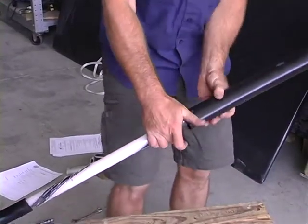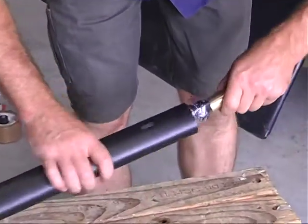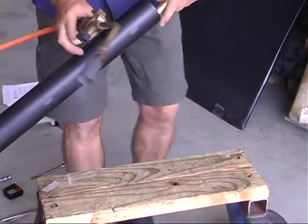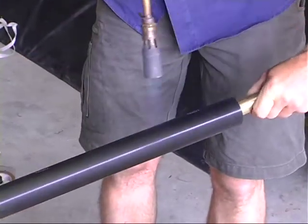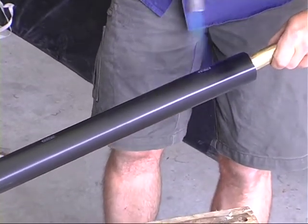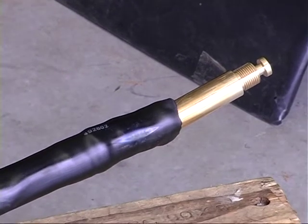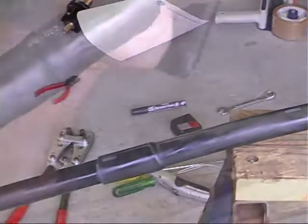Place the 600 millimeter heat shrink tube over the cable at this stage — ensure the semiconductive tape is not damaged. Overlap the previous tube by about three centimeters. Shrink seven centimeters of the upper end of the tube into place so that it sits flush with the base of the mass butt adapter when fitted. Shrink the other end so that it overlaps the previous heat shrink tube by three centimeters, and continue along the full length to achieve a smooth overall finish.